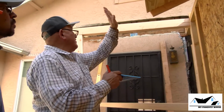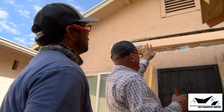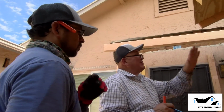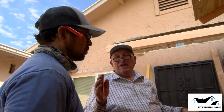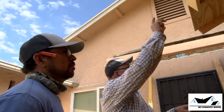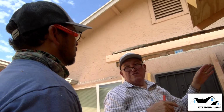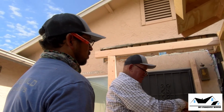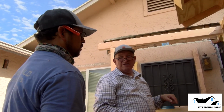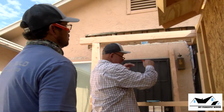But you have your fascia here. You put your rafters up here. Okay. So get your fascia all ready, and then you can get your fascia on. And your fascia, you'll cut at a 5/12. Don't cut it at a 5/17. When you put this piece in here and they come together, these will be a 5/12, not a 5/17. The only thing that you cut at a 5/17 is the actual hip and valley itself. Okay, 5/17.